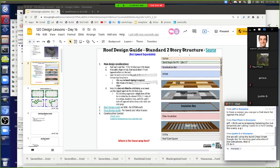So this is actually the industry standard for a flat roof. In this climate, the tempered zone, you've got to have 4 inches of rigid, and then the fiber insulation underneath that. The rigid is so you avoid condensation in the fiber. Because the roof's going to be cold, you've got to keep the heat in for condensation to be avoided. So that's a functionality issue.